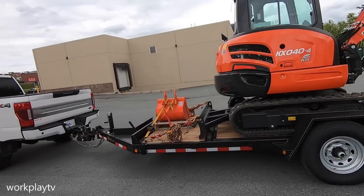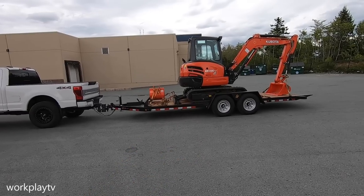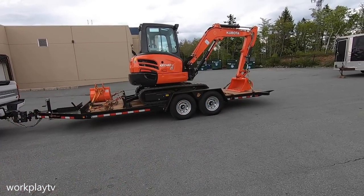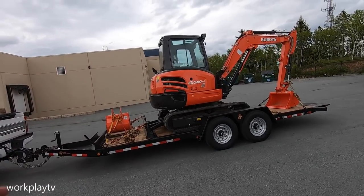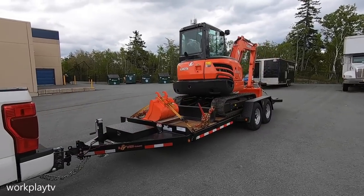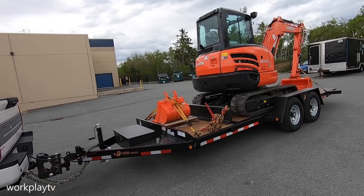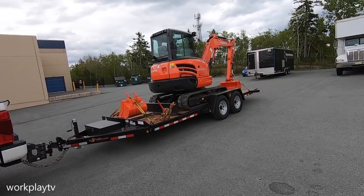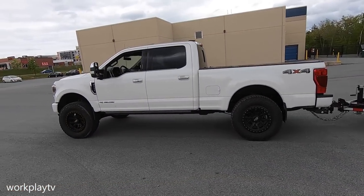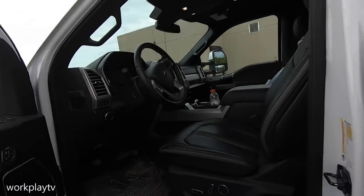Yes, we went with the Kubota, of course. We got a four-ton — so before we were riding with the eight-ton, now we're riding with the four-ton; we cut things in half. I can tow behind my 2020 or my 2019. Perfect setup. We've got room for the bucket in front; I could turn it sideways and make more room. The mulcher will fit because we're definitely going to be below 13 feet, which is what we want. We are rocking and rolling and ready to go. We're at about 9,500 pounds for the machine and 3,400 pounds for the trailer, so we're at roughly 13,000 pounds behind the truck. We've got the Gen Y hitch on, brought it up one level, and we're sitting nice and level.